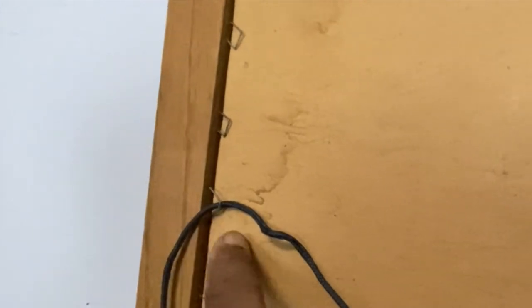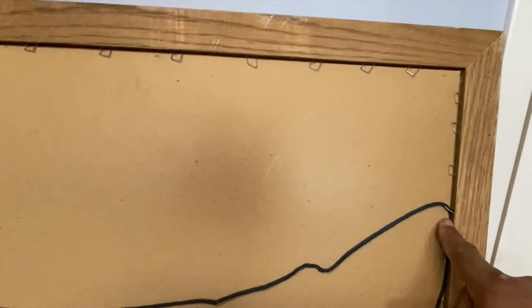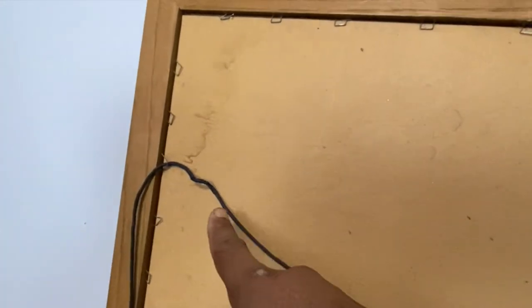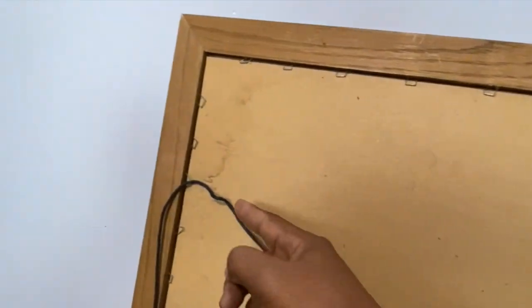You don't want to do that. It's very, very dangerous — those staples are not that sturdy if the weight of the picture frame is hanging on them; they'll come out really easily. Fortunately that did not happen with this picture frame, but you don't want to do something like that. You want to have the appropriate hardware like D-rings fastened to the frame itself and the wire connecting to the D-rings.